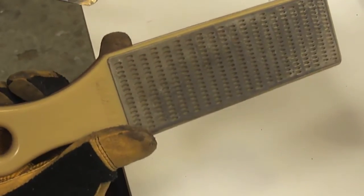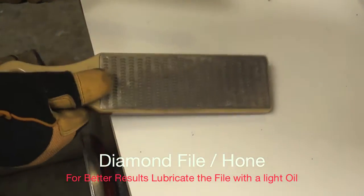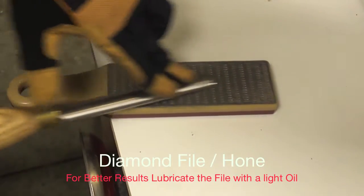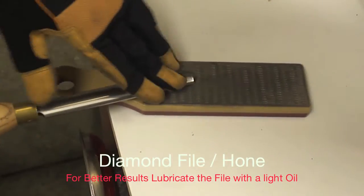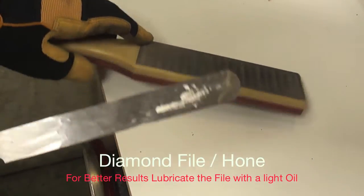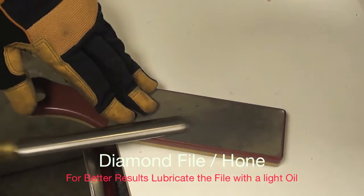The diamond file and hone. Using a combination diamond file and hone, we are going to do the sharpening process of the spindle master. By placing the hone on a flat surface we are going to move the tool back and forth. Remember that in this process we need to apply a light oil as lubricant. I do not recommend using water for this sharpening process.